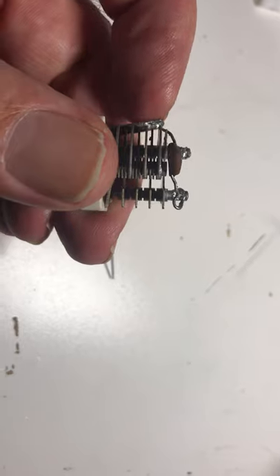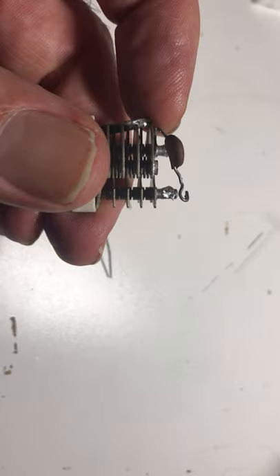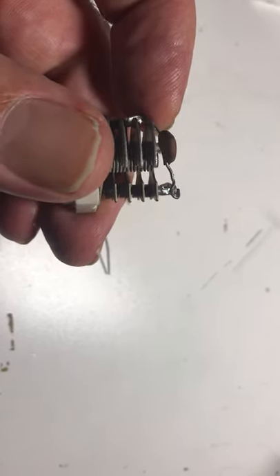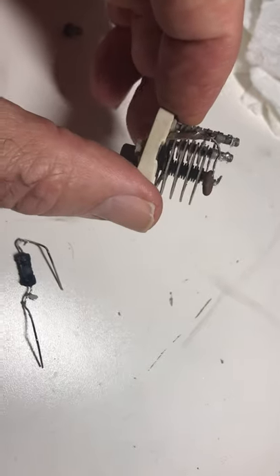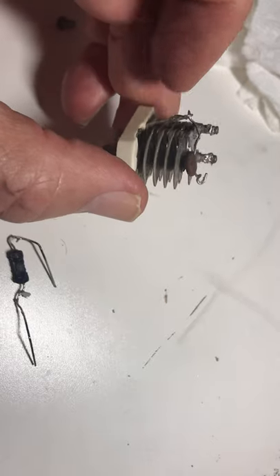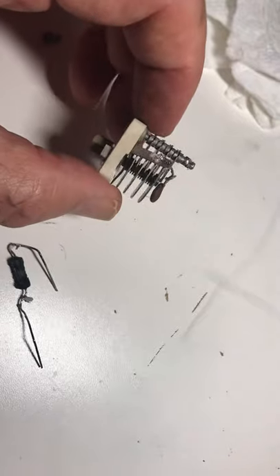This resistor was acting as a gatekeeper — 650 volts was going into the 250-volt supply at a greater current capacity than the one-watt resistor could handle. In a way, the one-watt resistor might have saved the rest of the circuitry. It blew the filament fuse and smoked out the resistor. I foolishly put a second resistor in there to debug the problem, about half an hour ago.